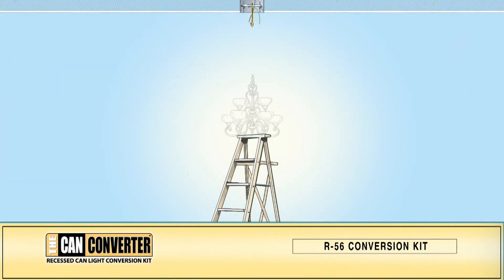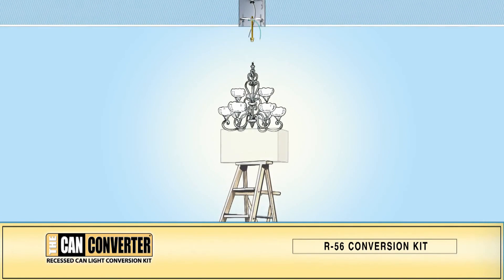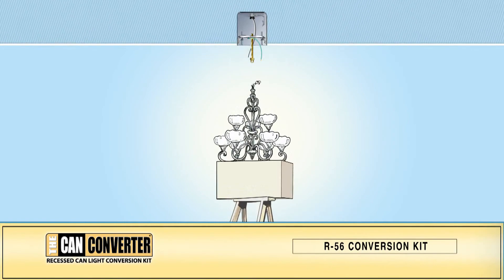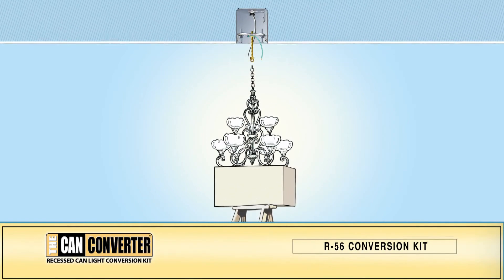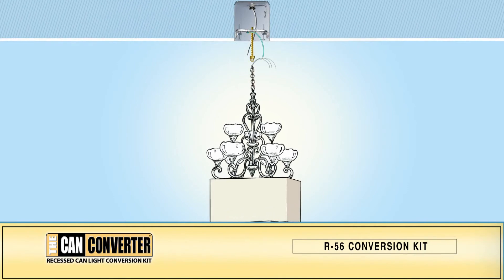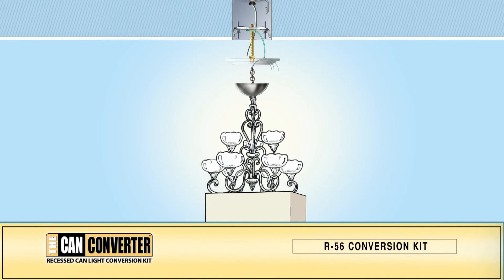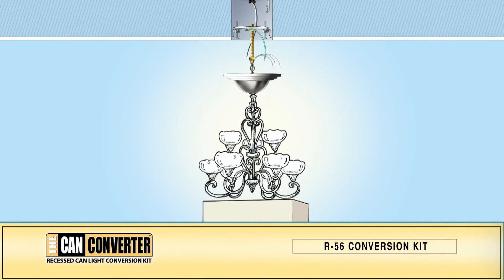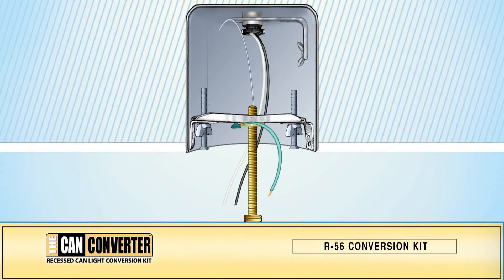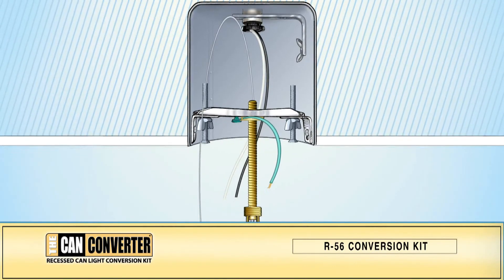Bring your pre-assembled chandelier into position. If the chandelier is awkward, you may want to place it on a box just high enough so that the end of the chain will reach the light hook. Thread the chandelier wiring through the links in the chain. Slide the chandelier nut, light canopy, and medallion down the chain. Now attach the chain to the light hook. Feed the ground wire all the way up through the light hook and the threaded pipe and down the inside of the can.